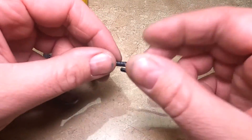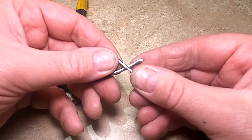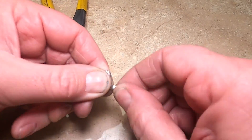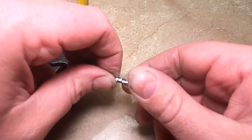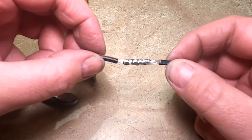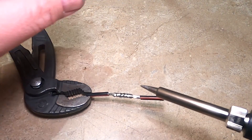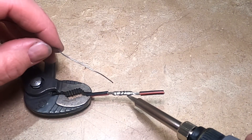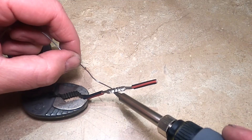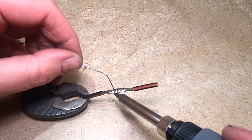Normally you'd want to put your heat shrink on first. So you make an X like this and you start twisting — just like that. Now it's already held together before you even solder it, so it's going to make a much stronger connection. Same thing as with the connector — you want to heat up the wire and let the wire melt the solder. What I usually do is use the solder to push down on the wire onto the soldering gun to heat it up faster.